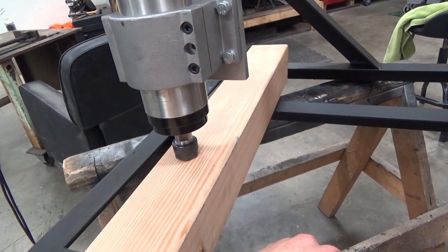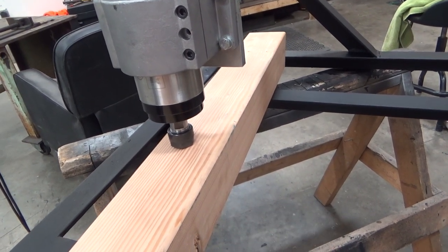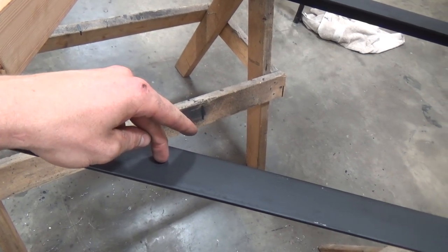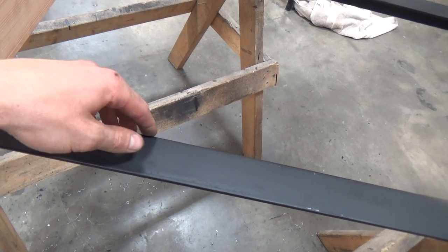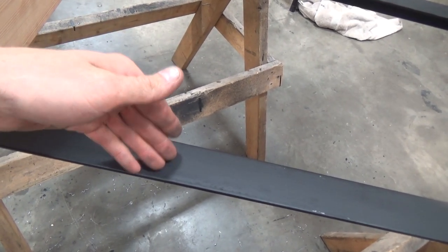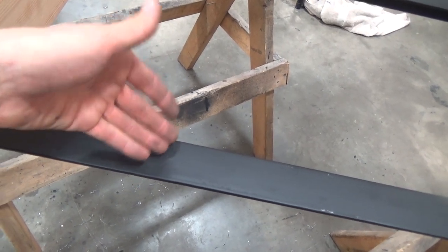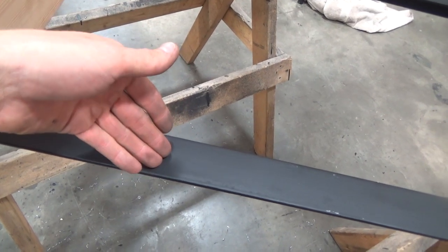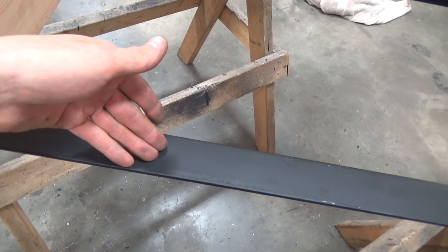Of course, if we really wanted to cut something really thick, well, I'm planning on putting a 1-inch non-removable, or non-replaceable, even though you could replace it, wasteboard on here. On top of that, I plan on mounting a 3/4 inch or 1 inch, whatever I have, MDF wasteboard with threaded inserts, which would be redone whenever you need to refinish or replace your wasteboard.